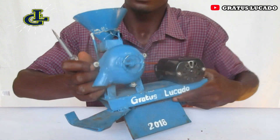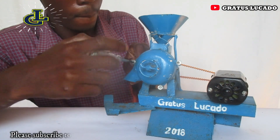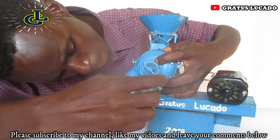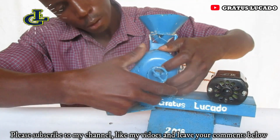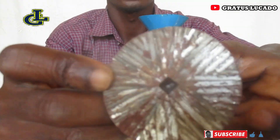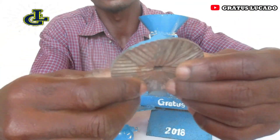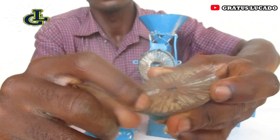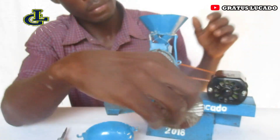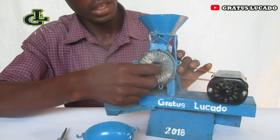I'm quickly going to open the inner part here so you can see what is happening. That's how the inside of my cornmeal grinder looks. I have the teeth — you can have a look. I used it for quite a long time. Over here it's just a metal plate that you can use for copper. I used a grinding machine to make the teeth. I have teeth here, another set of teeth over here, which is also metal. I welded this one to the body, and I have my shaft here.